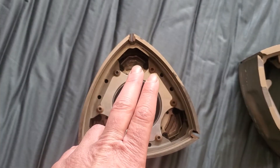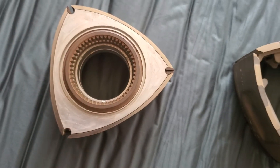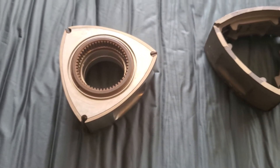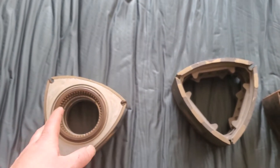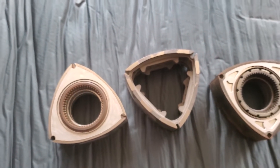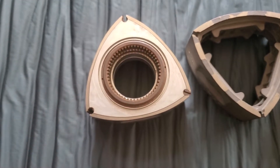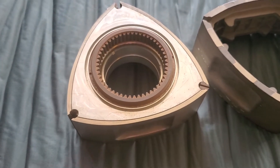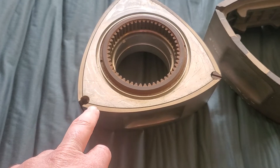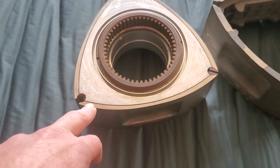So the combination of aluminum, titanium, and steel ended up being used to create an extremely unique and extremely lightweight rotor — I believe probably one of the lightest rotors tested, at least at that point when we were doing this with Mazda Trickz while I was working there as an engine builder. We don't know of anybody that had anything lighter or got any closer to functionality. One of the issues we did have — and it all came back to seal tolerances — was the ability to get the proper side seal groove tolerance with no issues, no wavering.